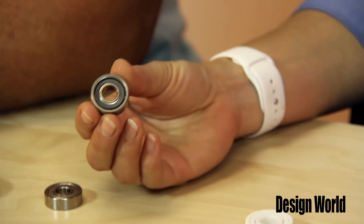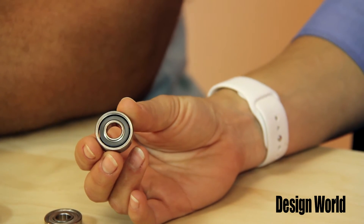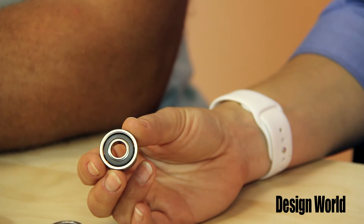Next, we have a YS-type bearing with ball spacers made of a lubricating-sintered alloy. With an operating temperature to 350 degrees Celsius, typical applications for the YS bearing are in sputtering equipment for semiconductor manufacturing and vacuum deposition equipment. Compared to bearings with conventional high-temperature solid lubricants, the YS bearing extends operating life by more than tenfold.